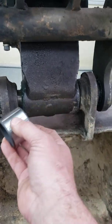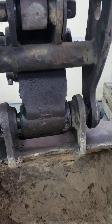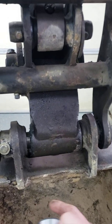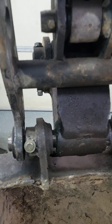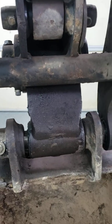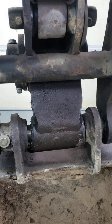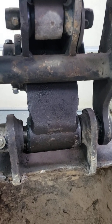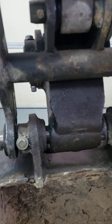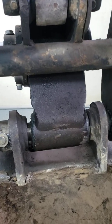If the bushings are misaligned, your pin alignment will be way off. A trick I used that I highly recommend: after I cleaned everything out, the bushings were completely gone — the pin had worn them totally out. The pin was basically rubbing against the frame of the excavator.